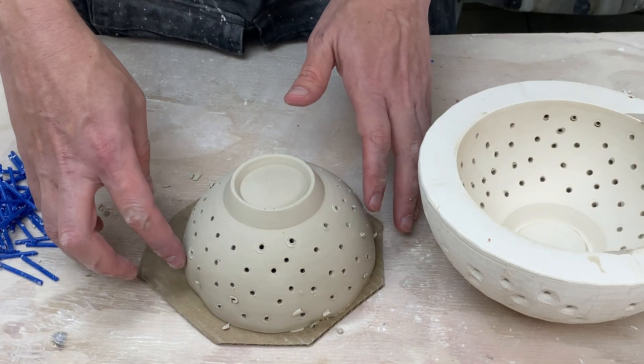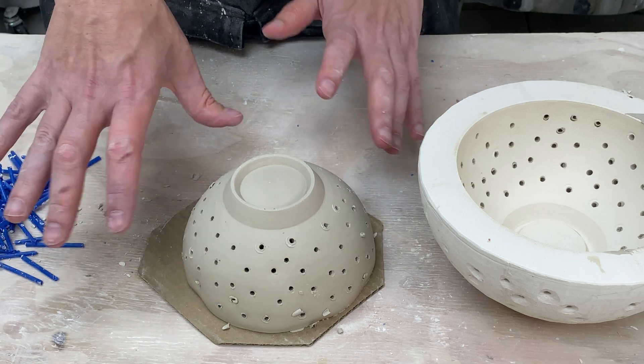I think I'm getting pretty close. The wax pins work pretty well in terms of shedding the slip so it doesn't build up. The inside surface finish is looking pretty good — I don't think it's ever going to be perfect but it should be good enough. The wax was definitely cheap and easy to cut. But the tolerances are definitely a problem — the fact that they weren't exactly three millimeters meant they were falling out, so the packing tape was definitely a hack. And there was slip that got into the holes, creating artifacts on the outside surface. I'm pretty confident this could be cleaned up with a sponge once it's firmer, but I'd rather not have to deal with that. So overall we have a process that works — I just need to find the right materials.